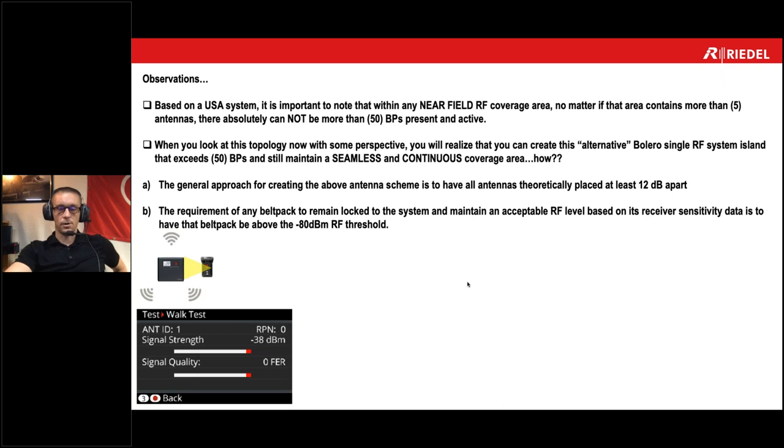So if you took your whip antenna, you had to know that whip antenna permeated like a donut out from that antenna. Now, if you put it up in the grid, your donut is partially lost, right? Because you've got part of it going up and then reflecting back down. You've got other metal things around, and it is nowhere near the receivers. So that antenna is not omni in all directions? It is, except for out the back.